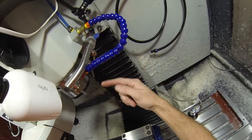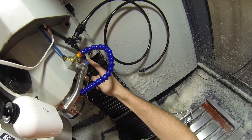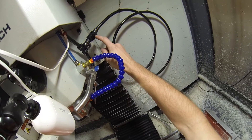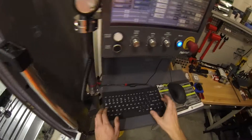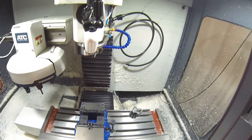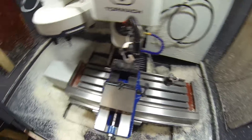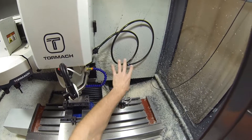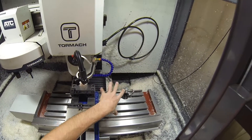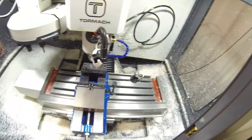I hooked it up in a way that it holds the line out of my way. I can leave my coolant on and shut the line off, or I can shut the coolant off and turn the line on. Obviously you wouldn't want both of those shut off, because that would be a bad day. The VR cable retractors very expertly hold everything out of the way and back away from the mill, so there won't be any wrapping your pneumatic line around an end mill, which would also be a bad day.